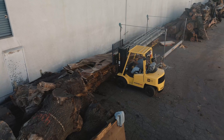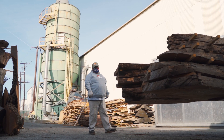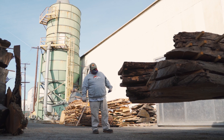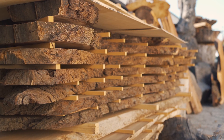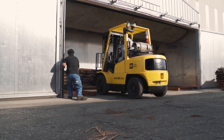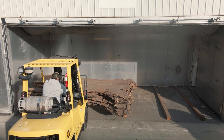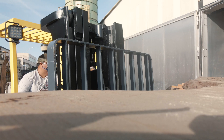Loading the wood in the kiln is always a fun exercise — it's kind of like a Tetris game. It really makes us scratch our heads sometimes because these slabs are not dimensional lumber. They're not square edge. They're all different sizes, large and small. So we're really looking at the best way to fit the slabs in equally so that the airflow is consistent throughout the load.